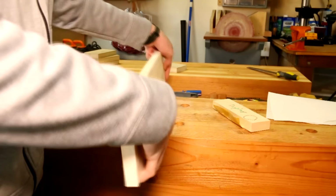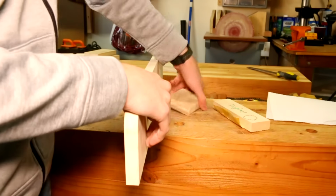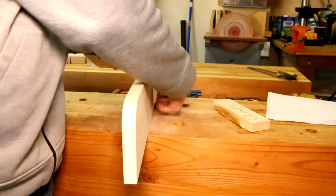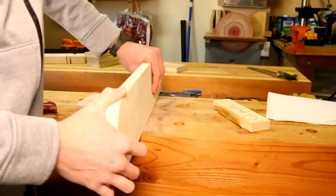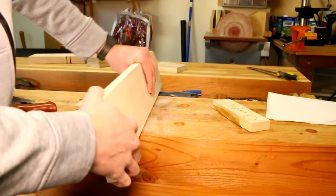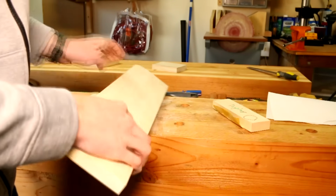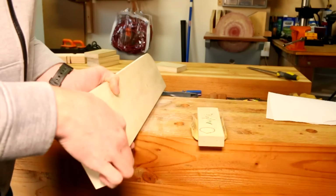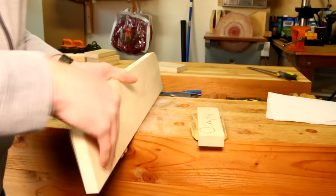So when this thing is on the sled and I'm doing a lot of cuts, it's really easy to have a piece of wood here and there be a bunch of sawdust under here that gets trapped between this piece of wood and the bottom of the sled. That can pack up really tight sometimes. So relieving that is super simple by just sanding away this edge right here, and this way there's a little bit of a bevel under here where the sawdust can go.